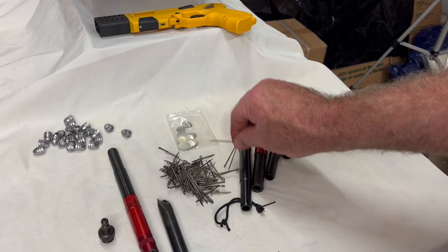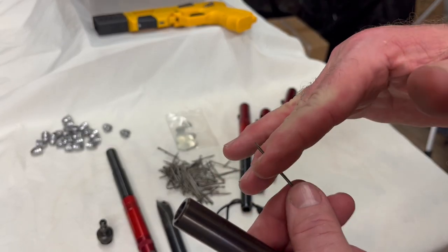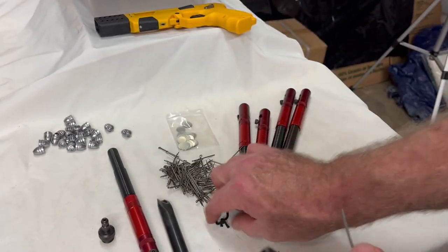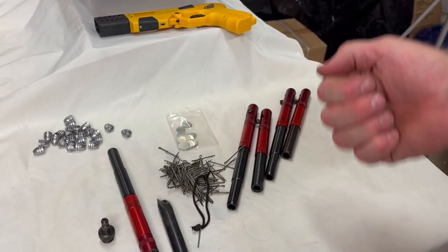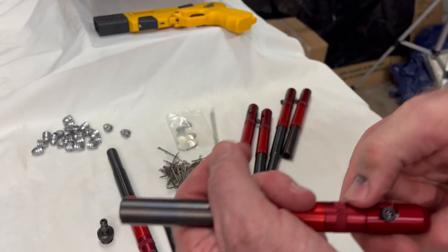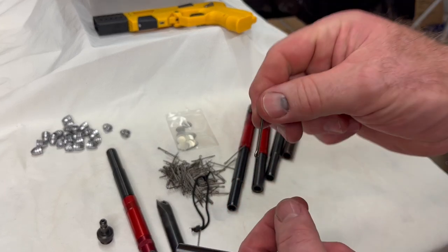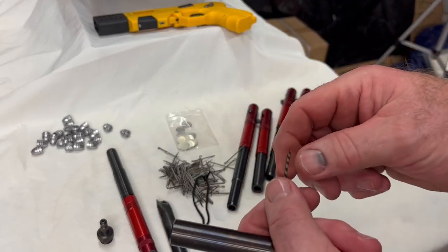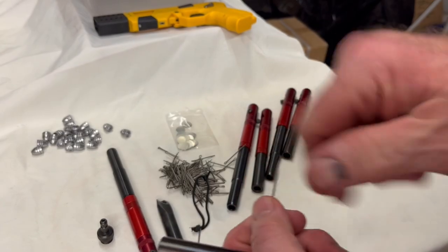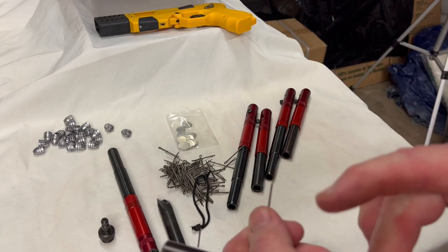What I've been doing is a cotter pin — by the very action of taking clippers and cutting the cotter pin, it bends it enough that you can't pull it back through by hand. Having a pull strip like this, you can pull it through fairly simply. But in the safe position, when it's riding on it, it provides that much more friction where you have to pull a little bit harder to pull the pin out. Until the pin comes out it cannot be fired. Once the pin comes out, if you have the air cartridge charged and a round in it, you bring it over, you release, it's going to burst the burst disc and it's going to shoot.